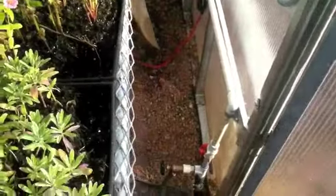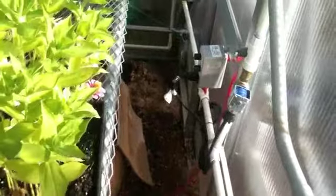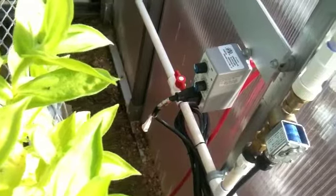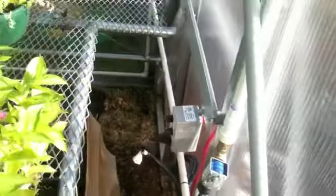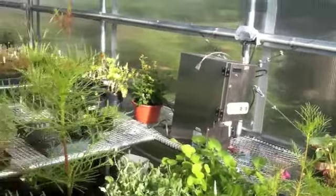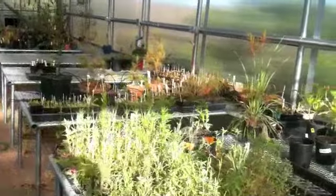Here's where my water comes in, right at this hose. I have a few shutoffs there. Here's my misting system — it's controlled by an on-off timer. Right now it's running on for 2 minutes, off for 45. So far in the summer that seems to be working out just about perfect. In the winter I don't have it run as much because it doesn't evaporate near as quickly.